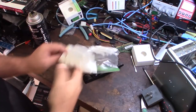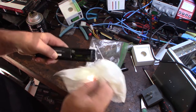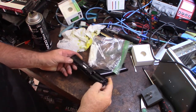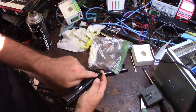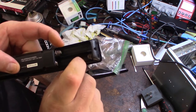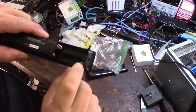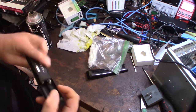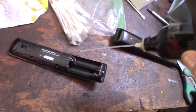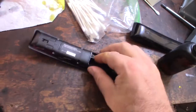All right, now that it's been soaking for a few minutes, I've got some Q-tips, and we'll just wipe this off. WD-40 works actually well too to prevent corrosion. You can see it's not shiny like the other piece of metal over here. It's already set a little bit, but it should be fine as long as we neutralize it to prevent it from going on. Okay, we'll try it out and see if it works. As an extra measure, I'm going to put a little Tri-Flow on here as a precaution. You can use a spray, WD-40, anything with a petroleum distillate.